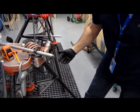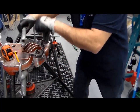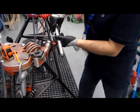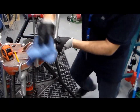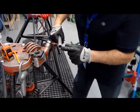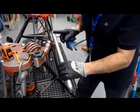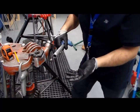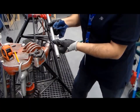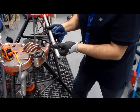Put your reamer aside and your pipe is done. Back off your chain, remove any oil or filings that might come out, and wipe away filings and any oil. Make sure that you have no burrs on the inside. You should now have a thread on this side and a thread on the other side from your electric threader. You're now ready for your instructor to mark your project. That is how you do your hand threading using the tri-stand, hand threader, and hand reamer.